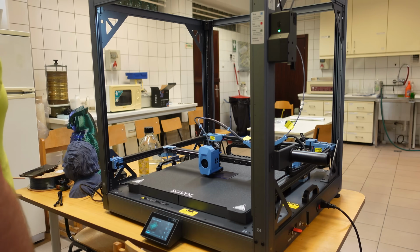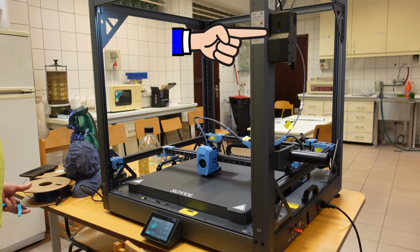I really like this Voron style open source huge volume printer, whole new possibilities for me. But there are a few facts. Almost for every printing where you want to use this printer and not some standard size, you will need more than 1 kilogram spool and more than 1 day printing with 0.4 mm nozzle. Of course we have bigger spools, 3 kilograms, 5 kilograms, the filament sensor works fine.